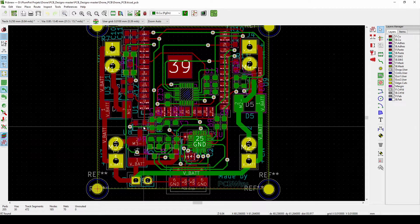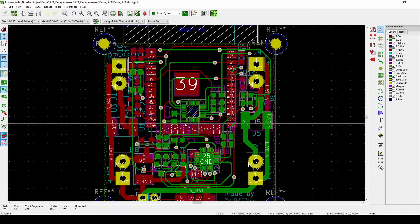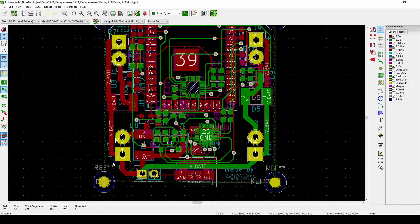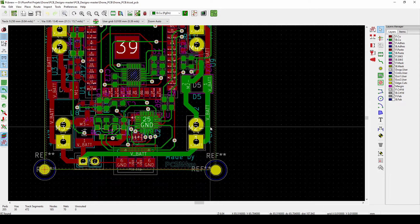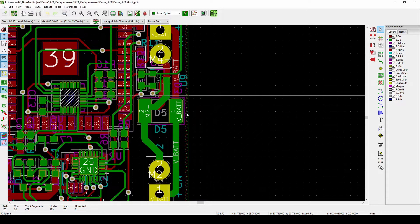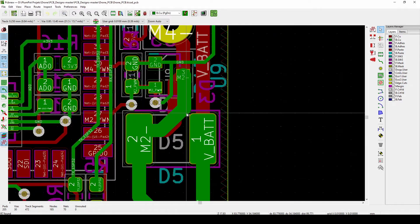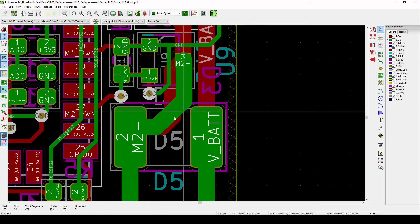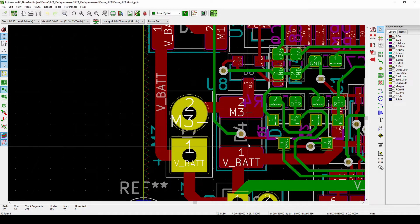When it's flat it's my zero position — perfect in the middle. I am not a drone expert, so it just felt logical to put it in the center. Please let me know in the comments if the center is actually not the right place. You can also see the power tracks are a bit thicker than the rest — power tracks should be much thicker. Current can get quite high — about one to two amps — so track thickness determines how much current you can handle. For voltage, clearance is important: the higher the voltage, the more likely it can arc across tracks. Current = track thickness; voltage = clearance/creepage.